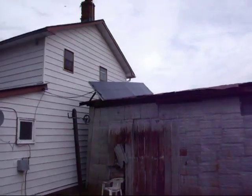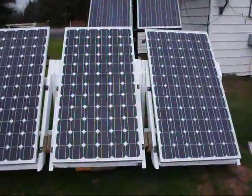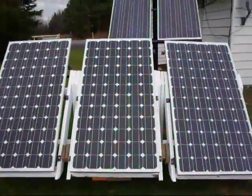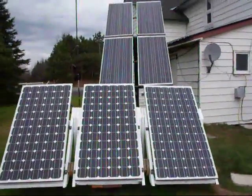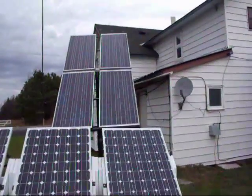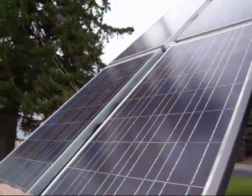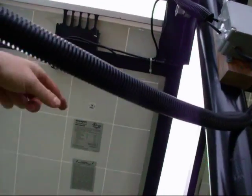So now we have those solar panels always on the battery banks through the charge controller. These three 180s go into a 600-watt grid tie, and on a three-way switch that also, if I switch it, goes to the battery banks through the charge controller. These four are matched up — I put them in series-parallel: these two together in series, those two in series, then they match in series-parallel. Negative to positive, then negative and next positive into the box.